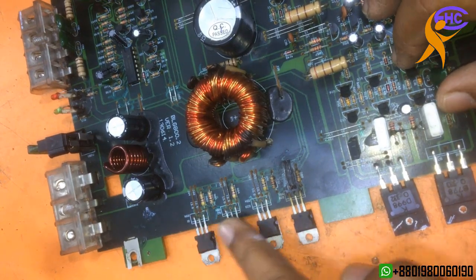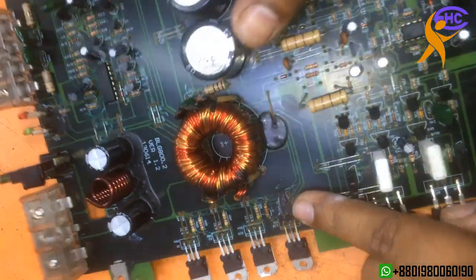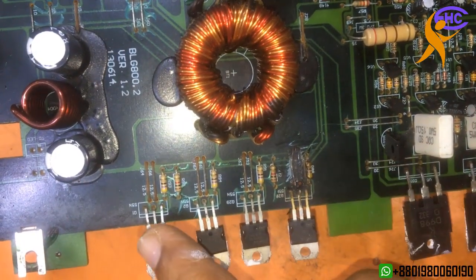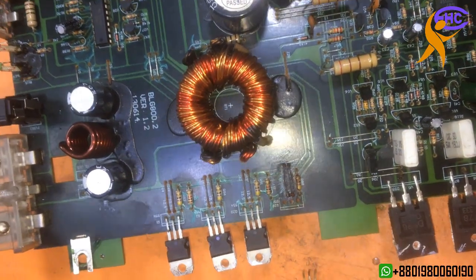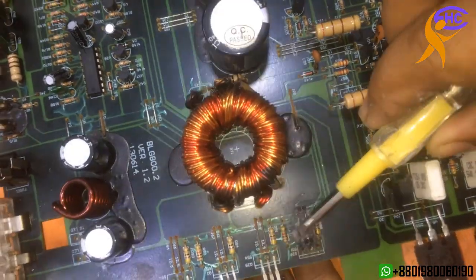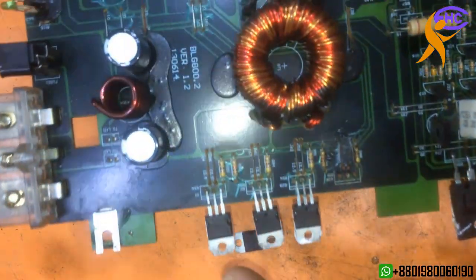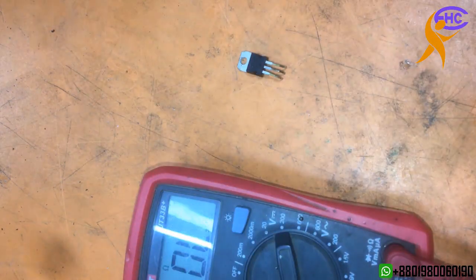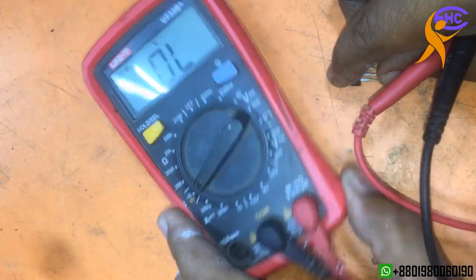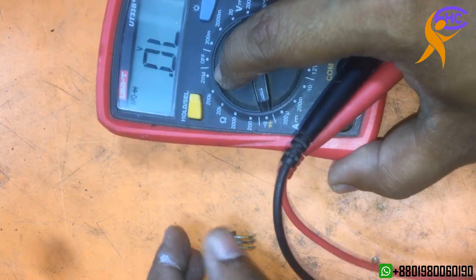This is a car sub-amplifier with four internal MOSFETs in the power section. You can see here they have burned. I have four internal MOSFETs — this is a car amplifier. I'm going to check them. They need a good quality MOSFET, but they used P55, and P55 is not comfortable — not good for this section. This needs a lot of current, maybe 30-35 volts, but the ampere is high. Let's go check the MOSFETs.